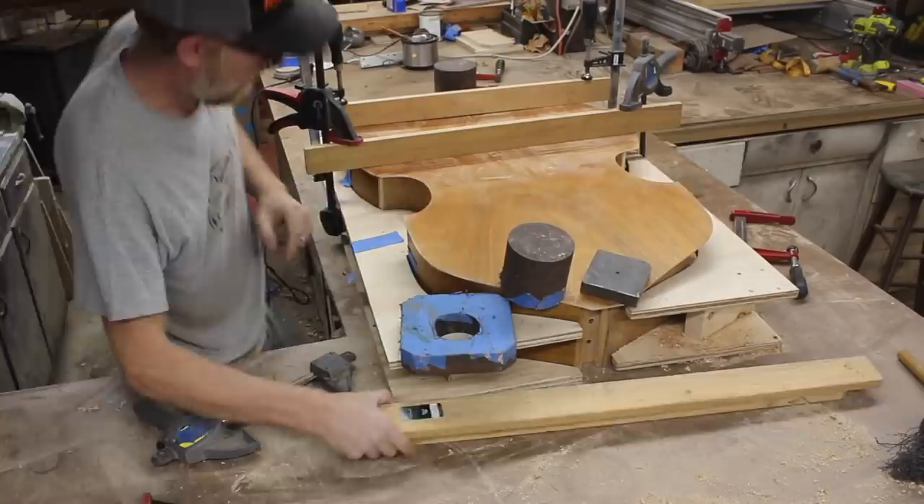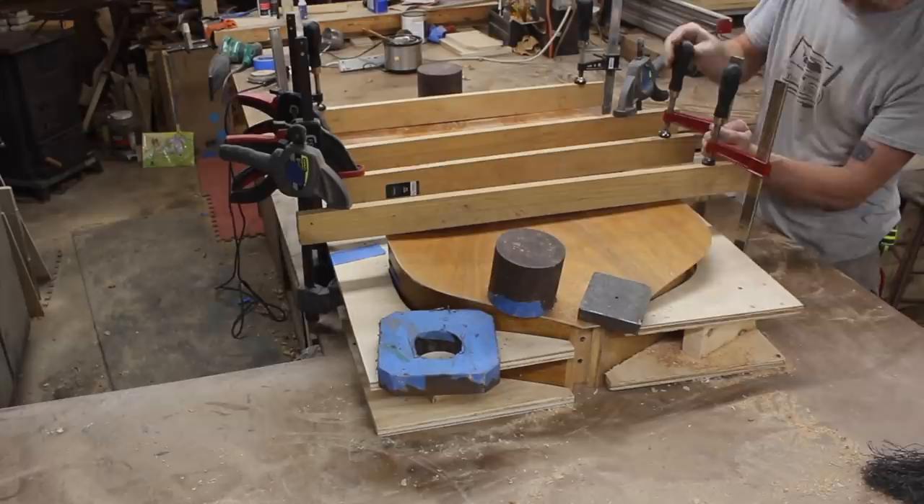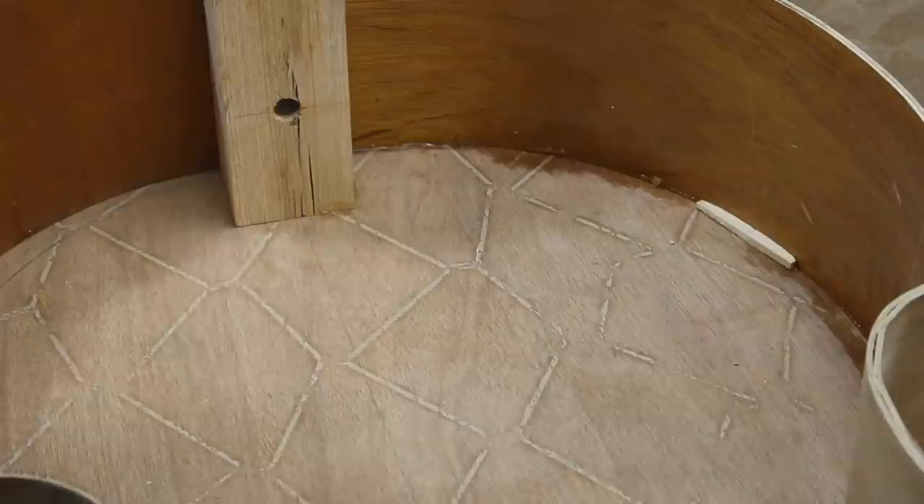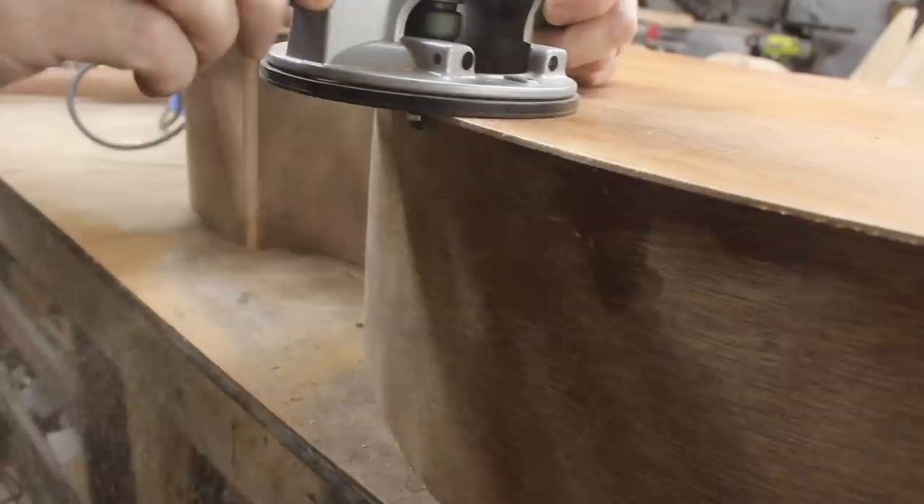I was a little nervous about getting all the glue on there and getting it assembled fast enough, so I was kind of rushing and feeling the pressure. I ended up having to redo the top half of the bass because I sort of let that slide while working, but it all came together okay. Once I had it together enough to flip it over, I painted the inside seam as well just for extra adhesion, then used a pattern router bit to trim off my excess back.